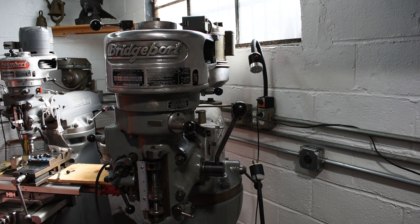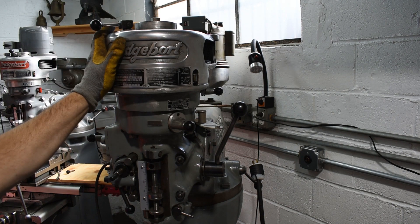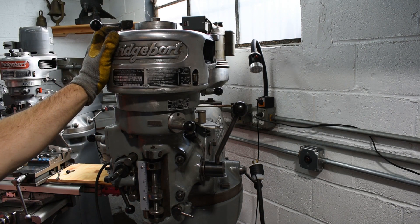I need to do some jobs on my rotary table, so I figured I'd set this mill up because it's got the smaller 36-inch table. I kind of figured I'd set it up with a small vice and the rotary table. Setup is nine-tenths of the job — if I can leave it like that and make it dedicated, I thought that'd be a great idea. Anyway, getting back to this: it's locked up. I've already taken the motor off, which was only two bolts.